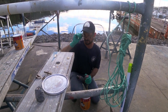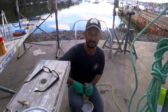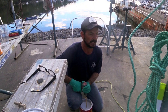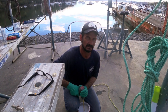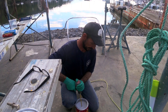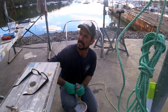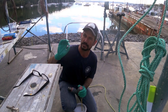You could ask anyone around the boatyard and get 15 different answers, so we always go directly to the manufacturer's data sheet. Everyone around here at the moment is using a Wattle brand paint, but we're going to stay with the Jotun because I know it works. I've been using it for a while and it's the same paint we've already got — it's compatible with itself. It's like an infinite overcoat as long as you key it.